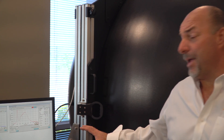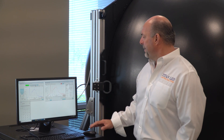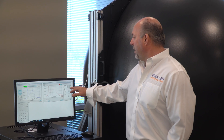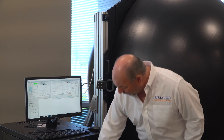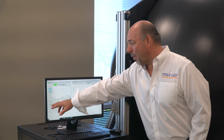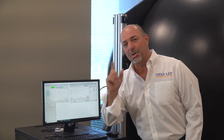So 174 and a half. Fantastic, absolutely fantastic. So what this is saying right here is that our goal was to hit over 160 lumens per watt with this new diode that we're using, along with the new thermal management. We did 2880 lumens. If you divide that out by the 16 and a half watts that we're burning, you got a record-shattering 174.5 delivered lumens per watt.